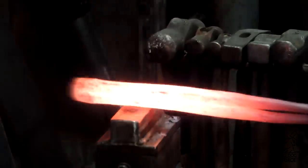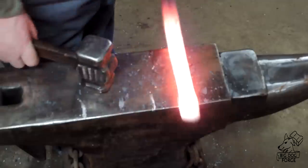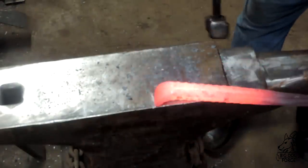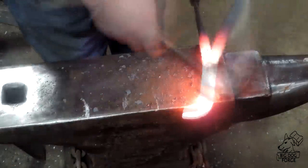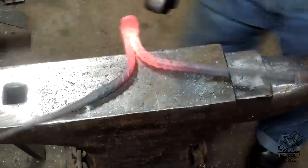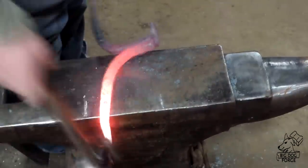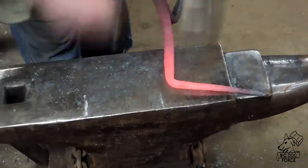You saw my little drawing on the bench — sort of a Y-shaped leg coming up off the floor. I'll bend a little foot into this thing, giving myself a mark at about that five-inch mark — this will be our foot coming up off the floor. This thing will sort of wishbone up towards the stand, and then we'll wrap those drawn-out sections down alongside the stand, maybe give it some waves or something. It's been a while since I've had a hammer in my hand. I grabbed the big old Alex Steel three-and-a-half pounder — kind of fun to use once in a while, though it's a little heavy for an everyday all-day-long kind of thing, but it does move some material.